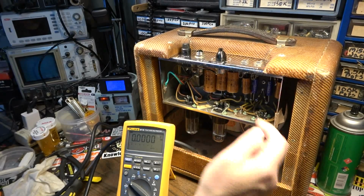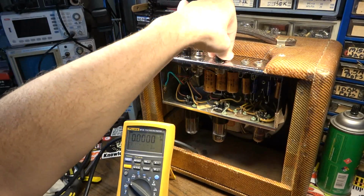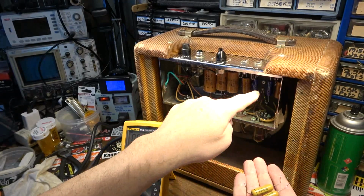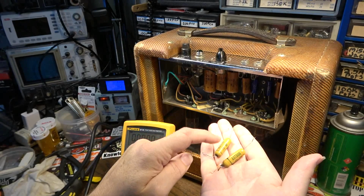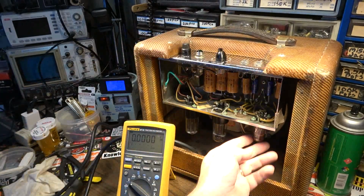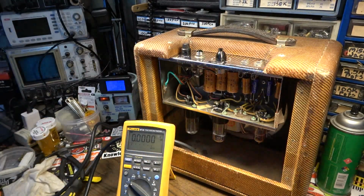And this one is definitely microphonic, and you can even hear it just from tapping up here. It's not nearly as bad as it was, though. So we had a microphonic as well as leaky capacitor. One of these was for sure microphonic and leaky. The other one was leaky to an extent and was also perhaps a little bit microphonic, we found out. That's actually not bad. I mean, you could roll with that right there. It's not terribly microphonic, but it is a little bit microphonic.